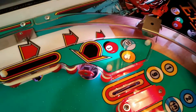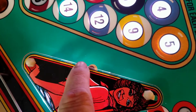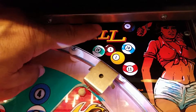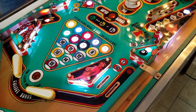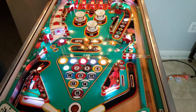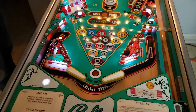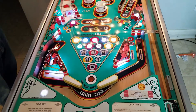There are other places where you can see a bright spot but the surrounding area isn't lit up. Over here there's a sorely missed dark area we need to light up, and up near where the ball is, part of that area is dark too. What we're going to try is pushing those LEDs a little deeper into the hole to get the light up farther. If that doesn't do enough, we'll look at plastic diffusers to add under the table to make the light more omnidirectional so the plastics light up more evenly.